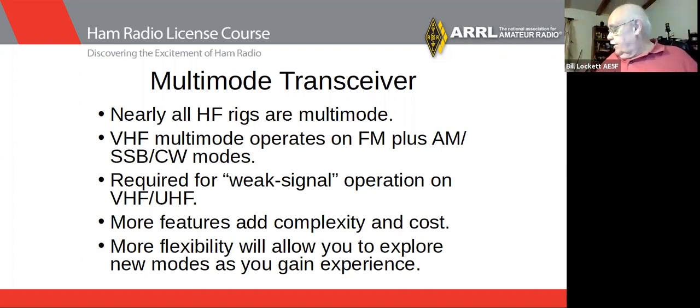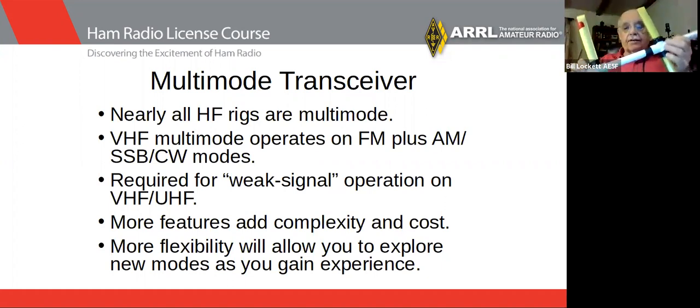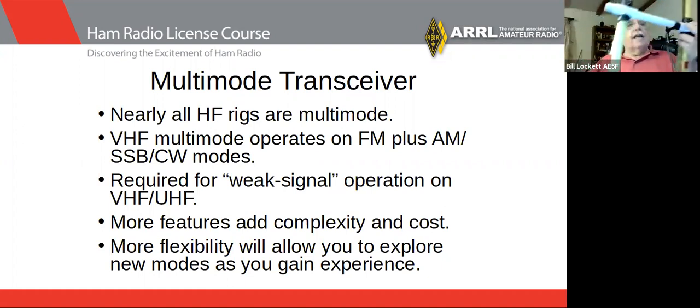Or in some cases, hurting your antenna. Now, we built in class, Mark told you about his tape measure antenna kit. And you can also use this for VHF or UHF, with this connection. And this has a hairpin device on it that reduces the impedance to 50 ohms, what we need. But this is to make the 50 ohms. This is the driven element.